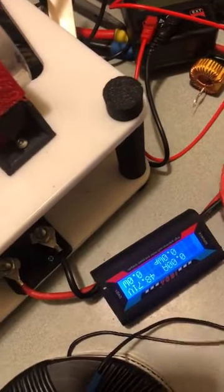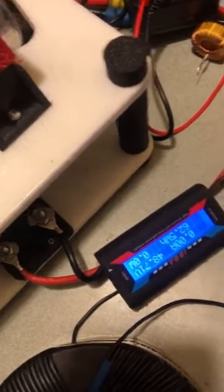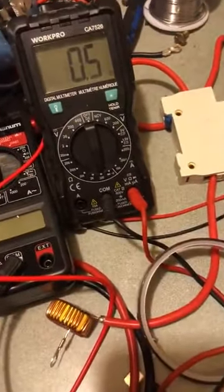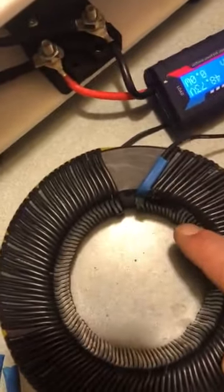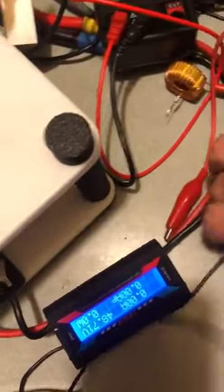Let's take this right off so that it's just the resistance meter on this wire. If it's 1 ohm, that would be great. No — it's 0.5 ohms. So the resistance is the same as the original two-piece wire test. It's a half ohm resistance. Just maybe even a little less. Might have to put an extra layer — maybe six or seven layers. It's going to be a busy choke.